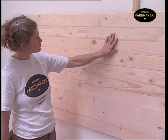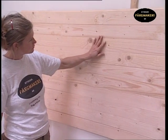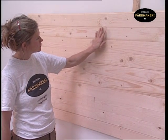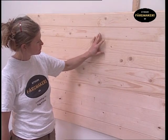One coat paint for wood indoors is used on untreated surfaces that are absorbent, such as untreated tongue and groove boards. Note, however, that absorbent surfaces require a lot of linseed oil. The end result is a lasting, beautiful matte finish.